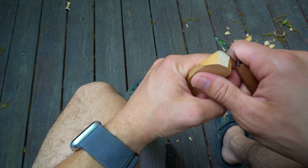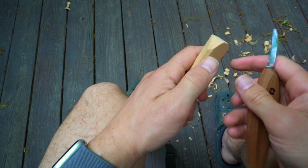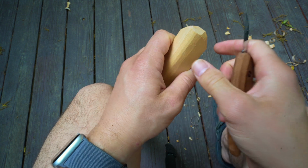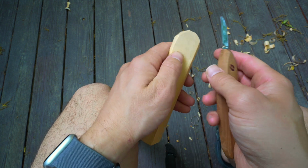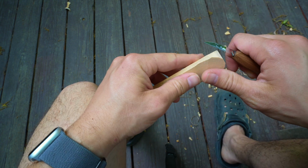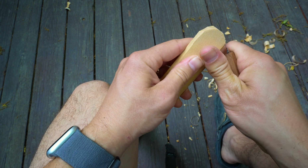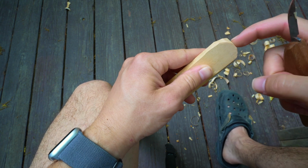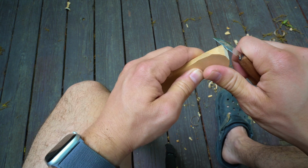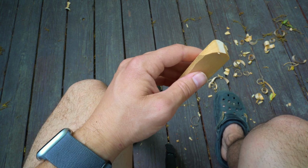Kind of round this bad boy by taking these planes and splitting them in half. That's the easiest way for me to make a round shape, is to stick with planes and continue to cut those planes down. So in other words, divide it up into 3 planes. We've got 1, 2, 3, and then cut that corner edge. So now what do we have? 5 planes? Yep, 1, 2, 3, 4, 5 planes. And then we can cut them down again, and so on and so forth. So we're taking these corners down, and that's what's giving us that nice round form.